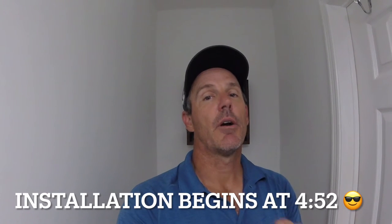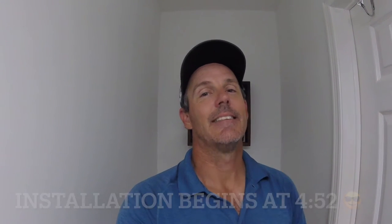I'm also going to show you how I install them on the back. Sometimes you buy a shelf and they're already on. You can kind of skip ahead and just see how I mark the wall to get the exact location. But if you want to see how to install these using a router and an edge guide, you can see that there's just a simple two passes, two different router bits, and you're going to have a perfect snug fit for those keyhole hangers every time.